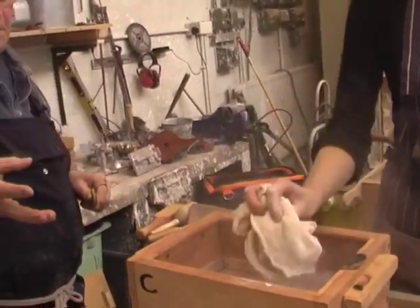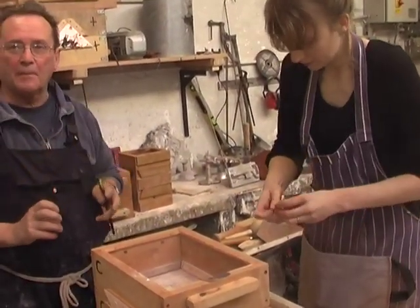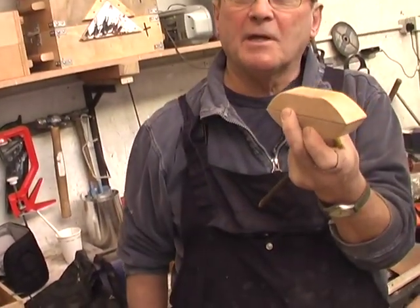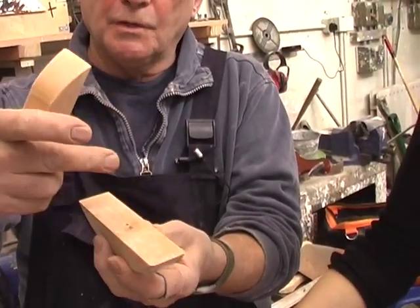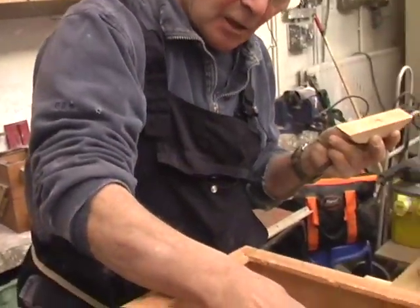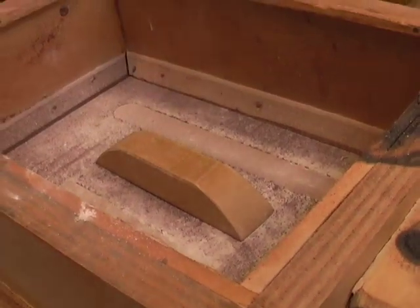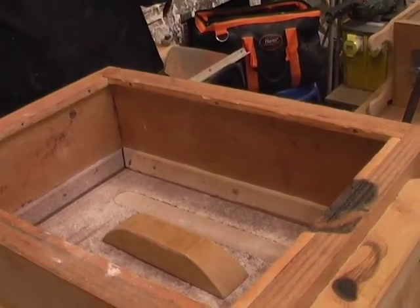If I can try to explain what might happen if you were going to use a different kind of pattern — for instance, another side of this. That becomes a split pattern, and a couple of pegs would have been drilled in here with corresponding holes, so that that pattern could be laid on top and locks into place. When we ram the sand on top again we will have the other side of the pattern in the top box, and when it's taken apart the pattern is split and each piece is removed.